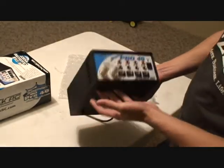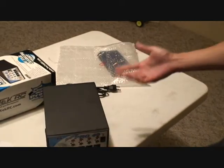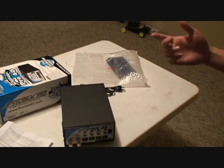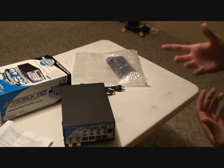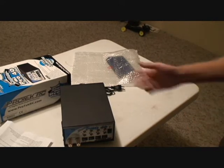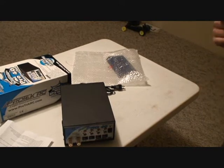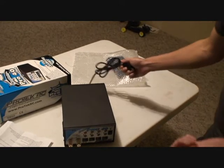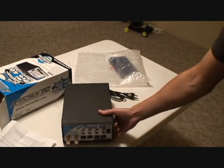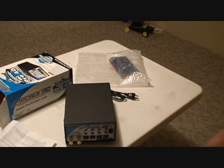This is the DC regulated power supply. Primarily what this is used for is to power your standalone DC battery chargers. With RC, we have a lot of battery chargers that are powered by 12 volts like from your car. And your car battery usually generates a lot more amps than the socket in the wall, and that's what this replaces — the car battery, so to speak. And because this is DC, it's converting all that AC into clean DC for you.